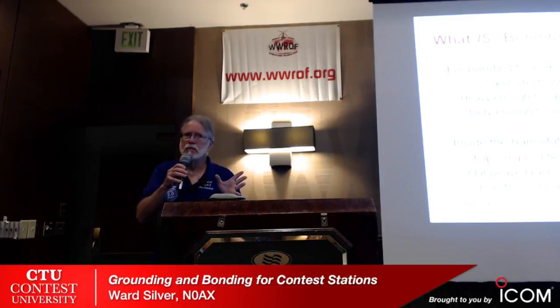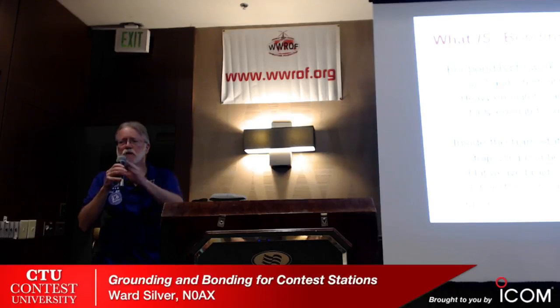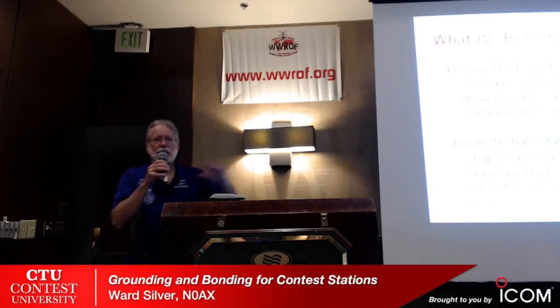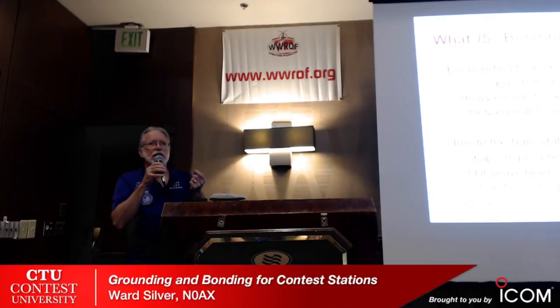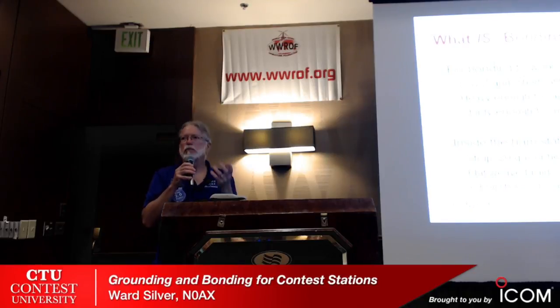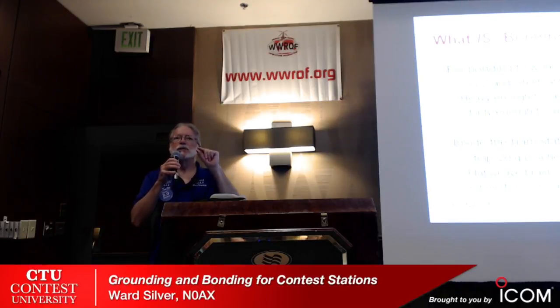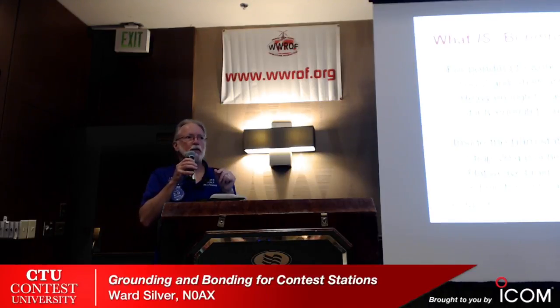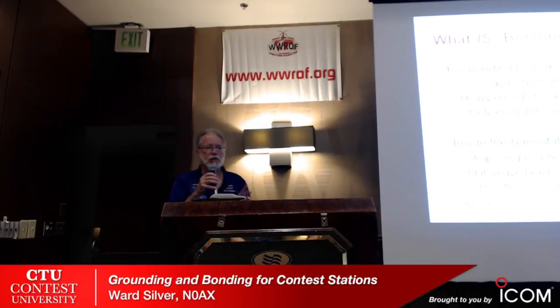If you're talking about lightning, use what the pros tell you. For RF management in the shack and AC safety, it's not such a big deal. AC safety conductors have to be heavy enough that if there's a short or fault, it will trip the protective device — blow the fuse, trip the breaker. That's why it has to be as big as the conductors in the cable: 14-14-14, 12-12-12, whatever. The ground conductor has to be heavy enough to do that, and sturdy enough to survive the environment.